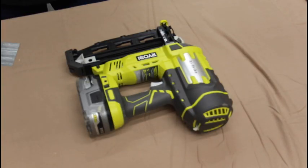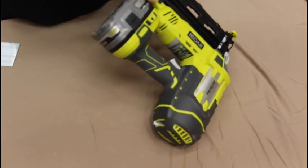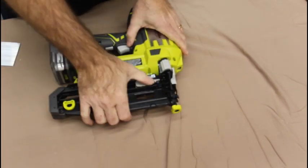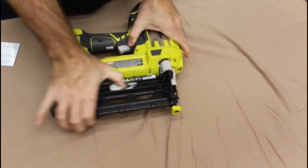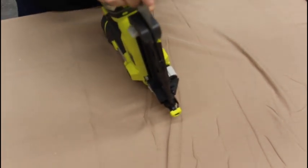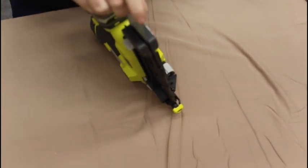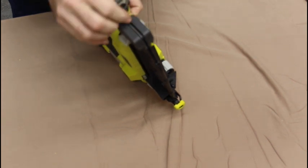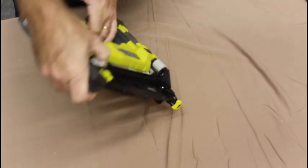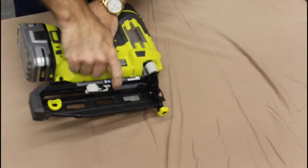Let's talk about some of the functions. Here on the P325, you load the nails by pulling this loading mechanism — it's spring-clipped. There's a release button right there; pull it all the way to the aft position where it locks, then slide the nails in head down. You can see there's a square here for the head, so it goes in right like that. You drop those down, and you can load two bandoliers in here, or if you have the longer ones, just one. Press the button and it seats against that.